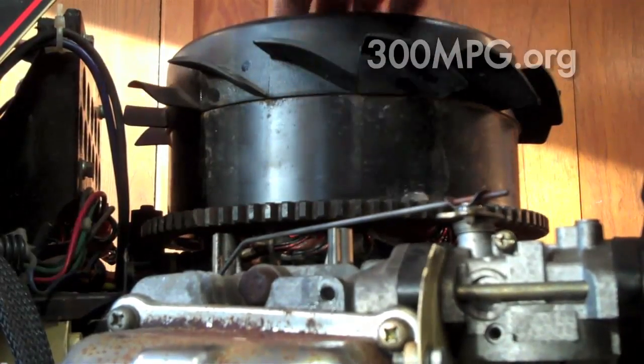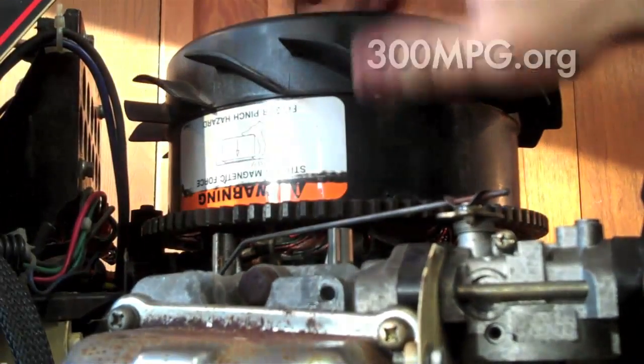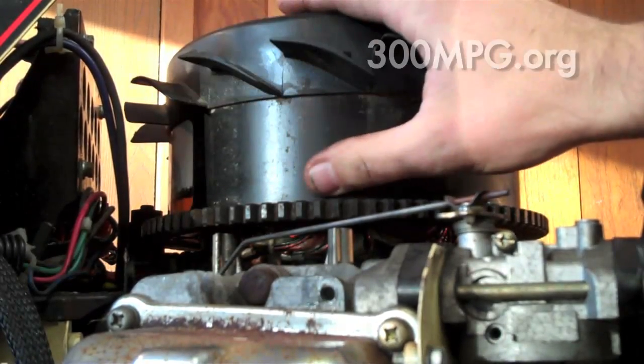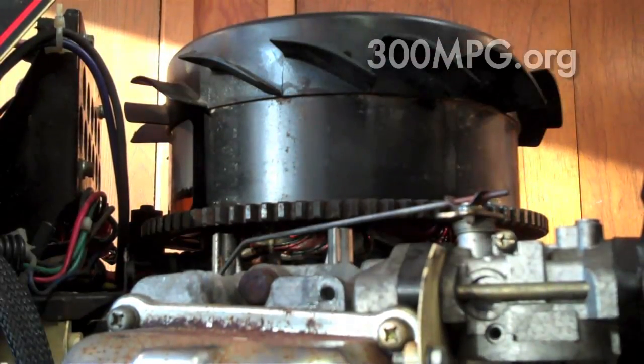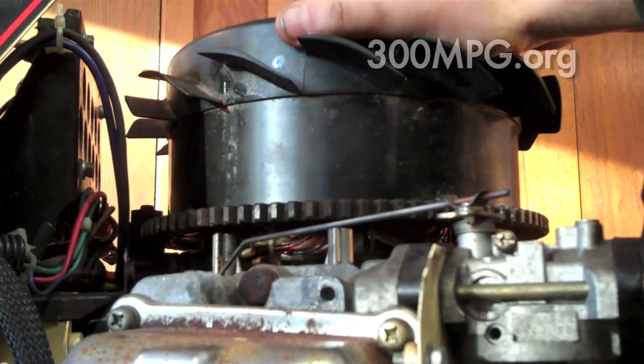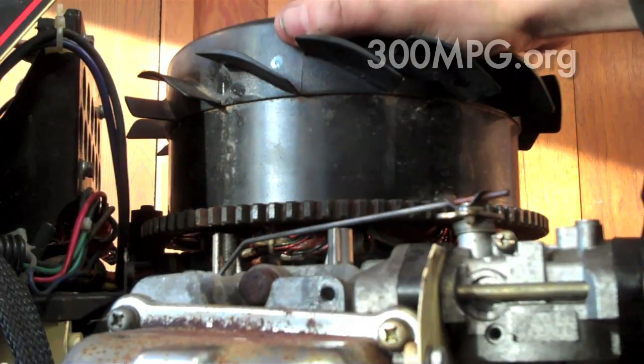What I'm moving here is the rotor, but the rotor is actually on the outside — so it's sort of an inside-out generator. What that does is it means you don't need any slip rings or brushes, which makes for a nice compact, powerful generator. And since it's propane, it runs relatively clean.